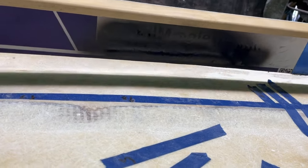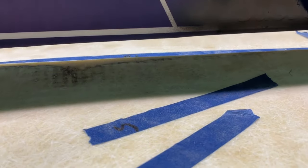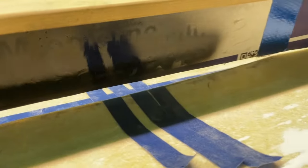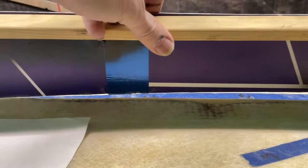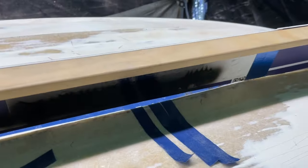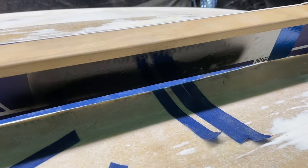So therefore I went over to the next fin here, and I thought that it's not fitting correctly. I just moved it up until it's supported here, and then I find, okay, this way, when I got it to approximately hit this point here and here, I see the gap I have grinded away. So this is what I want to build up with fiberglass, and I expect to have maybe 7 or 8 layers here until I get up to it.